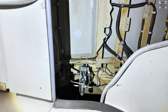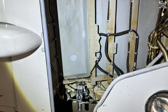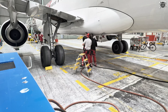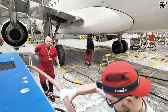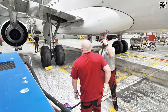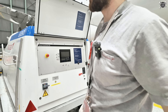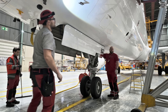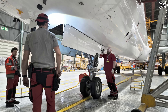During the test one part was to close the uplocks on the landing gears which are up there, so in that case we were able to close the door. I've already made a separate video only about landing gear proximity sensors - if you want it, it's in the top right corner or you'll find the link in the description below. And now you can see us removing hydraulic connections and preparing the airplane for normal operation. The hydraulic cart is packed, I'll just close everything, and we need to seal the bolts in the front section.